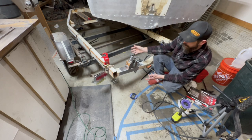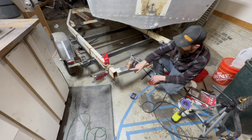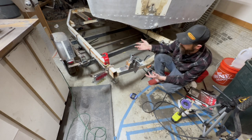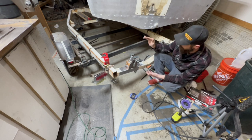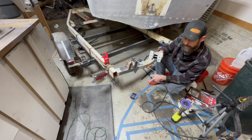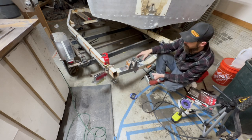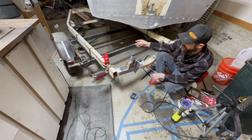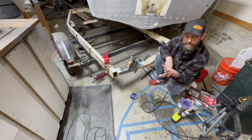Before doing all our finish welds, we need to fit up one side to make sure everything lines up as expected — we don't want to weld everything and then find it hits a rib wrong on the boat. We also need to determine the front riser height. We'll mount the rear bunk bracket to the bunk, bring it under the boat, fit it up, and take a measurement. Then we'll cut the front two risers, get the bunk brackets on those, and check back in. Let me take you over to the bunk we built in last week's video — make sure you go back and check that one out; I'll link it in the description.